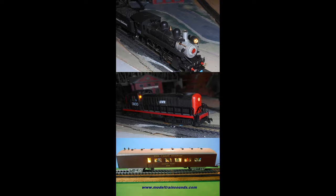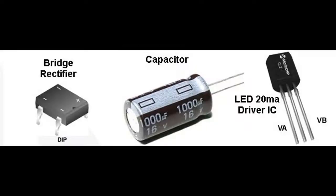The component items are also available in kit form. The three components used include a bridge rectifier chip, used to maintain lighting when the direction of the train is changed, and a 1000 microfarad 16 volt electrolytic capacitor. The capacitor is used to maintain voltage when rolling stock crosses a dead zone or the train slows, preventing light from flickering and holding voltage during short stops.